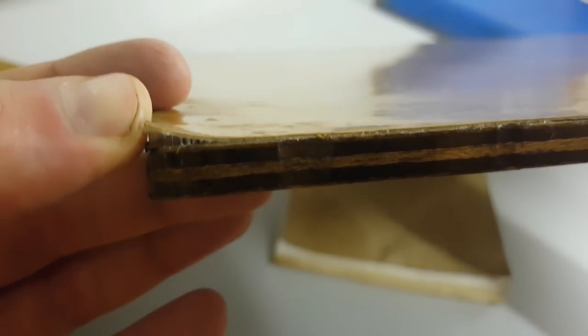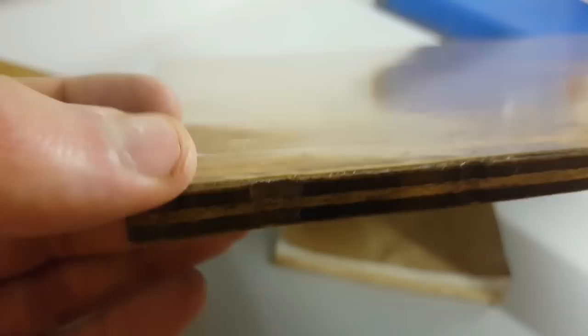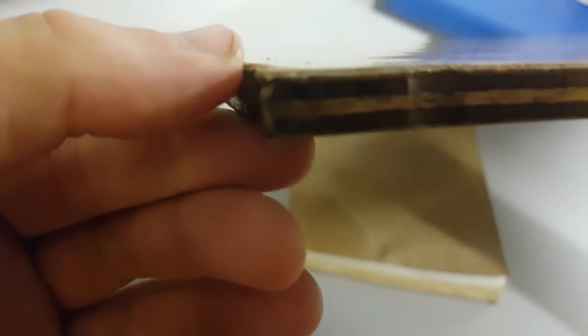The contact cement will be more difficult, but I'm having adhesion issues, like I said, with this pressure sensitive adhesive. And I know the adhesion that you get from contact cement is a lot better. So going forward, I think I'll redo these panels completely, although I'm not going to do it anytime soon. Another bonus to switching from the pressure sensitive adhesive to the contact cement is that the paper-backed veneer that I can get comes in widths twice that of the peel and stick veneer. So I'll be able to get away with not having to joint anything, because the gaps where I'm meeting up the veneer, some places are perfect, some places are horrible.